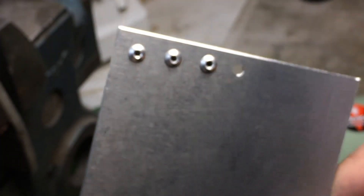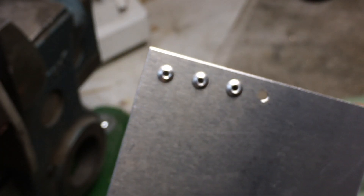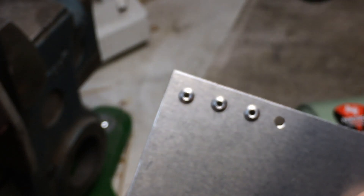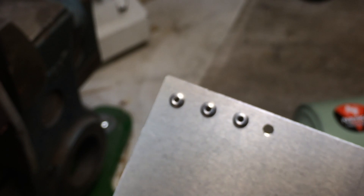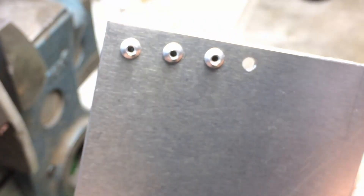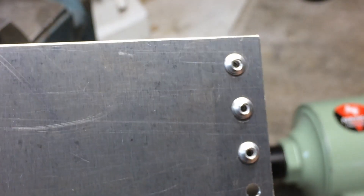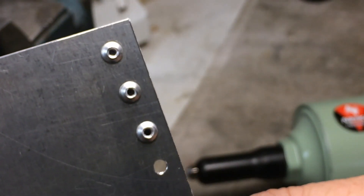Sometimes you'll see on the forums they say you need to heat your rivet noses to a cherry red to take the hardness out, and then reheat and quench them when you're done or just leave them that way. When you do this method — either with a carbide bit or with grinding stones — there's no need to heat them at all. Most of these imported rivet guns are not that hard on the noses anyway, and they machine just fine with carbide and grind fine with a grinding bit. I never had to heat one.